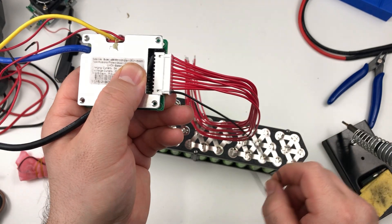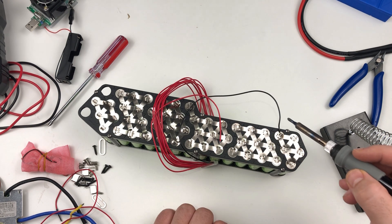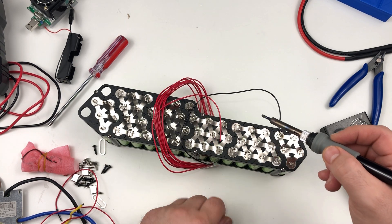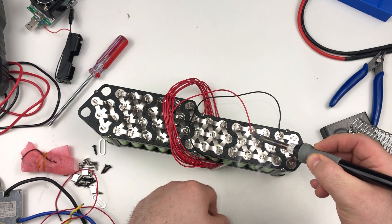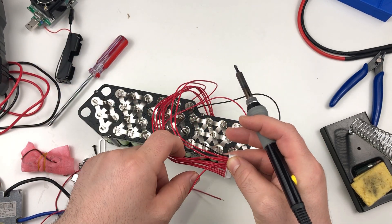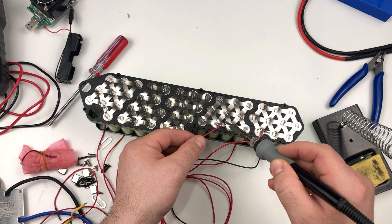The small wires are the sense wires that will be soldered on each series connection between the parallel packs. The first wire is the black one, which is the negative and goes on the negative terminal of the battery pack. The second wire is to be soldered on the other side to continue the zigzag pattern, but I don't want to waste time turning the battery pack back and forward, so I will solder one side first. You need to follow a zigzag pattern as the cells are connected that way — it's easier to do one side first, then do the other side. When done, I'll turn the battery pack over and solder the rest of the wires starting from the second in series.